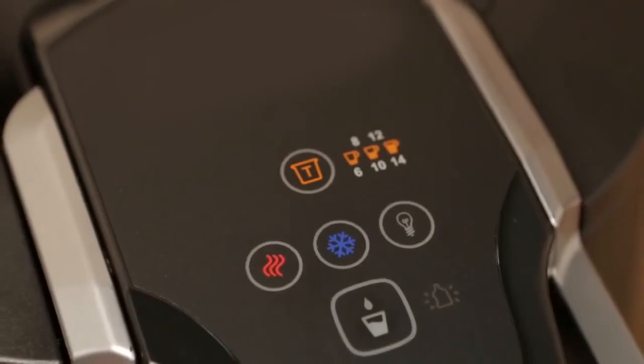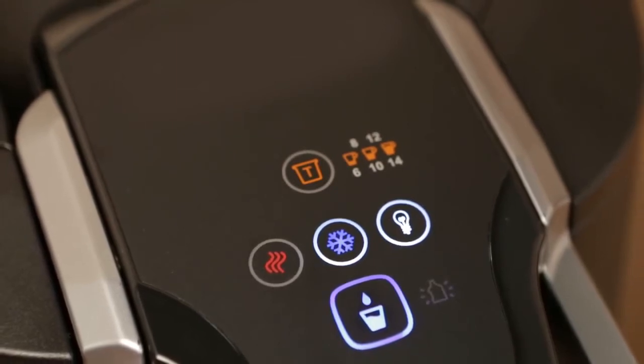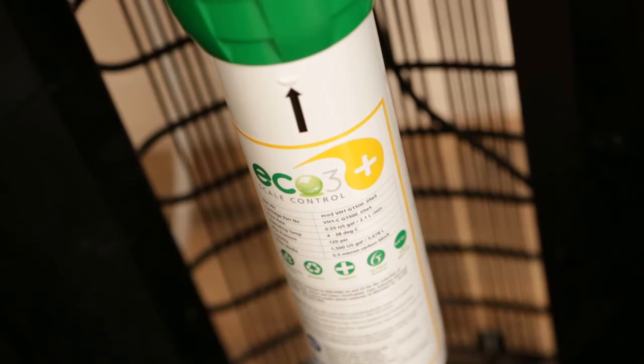This instantly activates the control panel, and after a short pause, the hot and cold water tanks will begin to fill. A flashing water bottle light indicates there is a water source problem. Check the water bottle level and the feed tube to ensure it is not kinked. For filtration applications, ensure water is flowing to the unit properly.